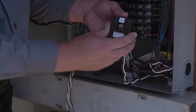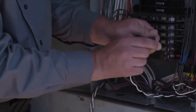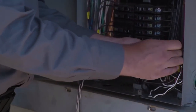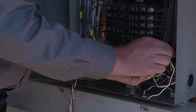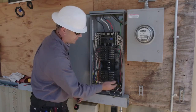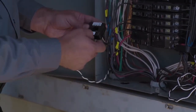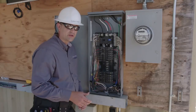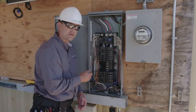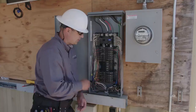Repeat this step for the other phase — put it on the L1 conductors, make sure that the label faces the utility, open the CT, wrap it around the conductors, and then close the CT until you hear it click. Because we have load conductors for the house exiting in multiple locations, we installed parallel CTs, so I need to go ahead and repeat that step for the load conductors on the other side of the service panel. Before we move on to the commissioning process, we're going to take a moment to check our work — visually verify that the phases inside the service panel make sense, and make sure that the CT label that says 'this side towards source' is actually facing the utility.